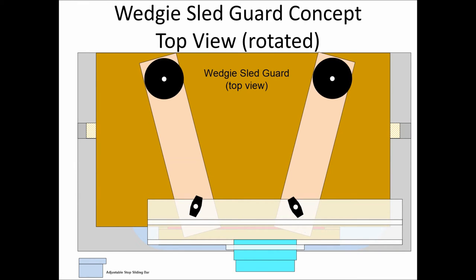Here's a top view rotated around to make it a little bigger so we can see it. It fastens down to the wedgie fences with just the knob. I had to make it long enough to clear the knob itself, yet still far enough over that there's some clearance between the blade and the first vertical upright piece. From this view you can see it clears the adjustable stop, which is set before the blade on the input side, and there's room for the three-inch dust port on the output side.